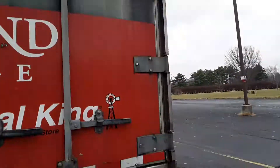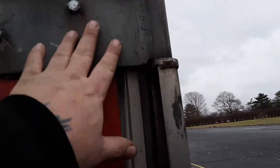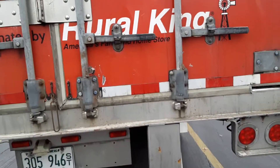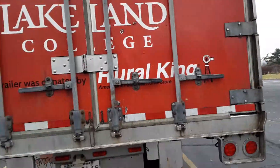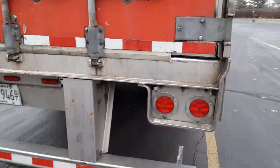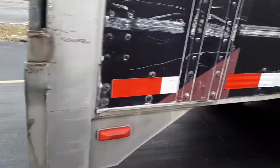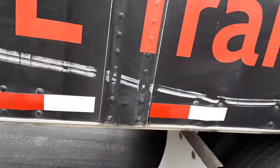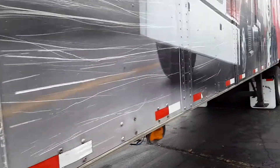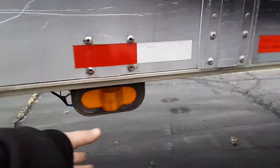These are your doors; your hinges are not cracked, bent, or broken, well secured — both present and tightened. Your locking handles, which are not cracked, bent, or broken, well secured, open and close properly, must have a soft rubber seal. Then your side lights — side must have 50% DOT tape.